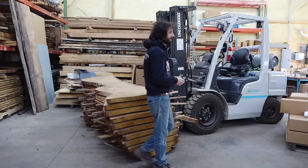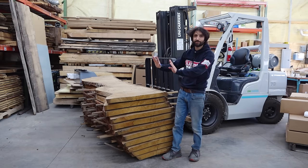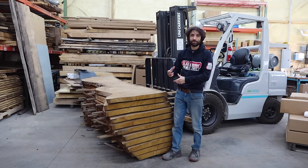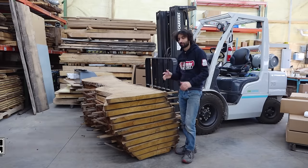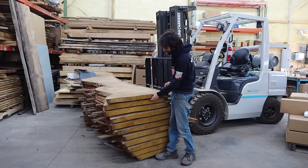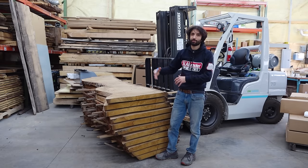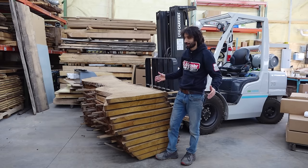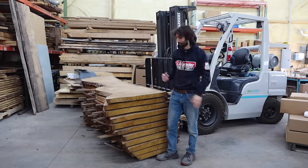And the biggest reason for that is that my corners, my posts or my legs, are going to be one piece. They're not going to be two faces, you know, mitered together. So the leg will be integral to each face. So on one side is 4 inches deep, that's the end panel side. And then on the cabinet side is 2 inches wide. So out of here, if I get a piece that finishes at 2 inches thick and 4 inches wide, four of those would be the four corners of the end panels and the four outside stiles of the two bays or runs of cabinets.